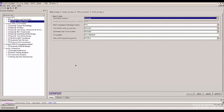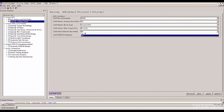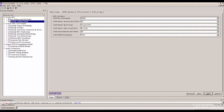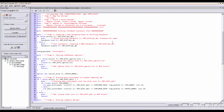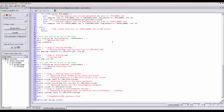Core Consultant allows designers to change or select the configuration through a simple GUI. This intuitive interface guides you through the available options for fast reconfiguration turnaround time. When you are finished, clicking Apply generates the RTL. The IP prototyping kit includes a proto-compiler DX GUI used for design synthesis, or TCL scripts to expedite the process and complete the place and route.